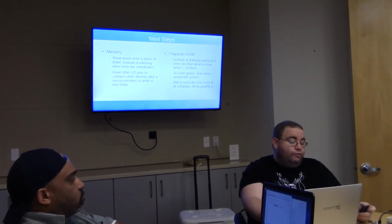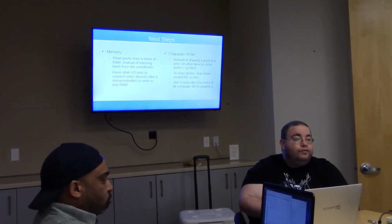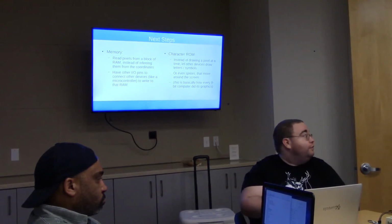So one thing his board does not have is any external memory. So his chip only has the block RAM that is available on the chip, which is 8,192 bytes. You can divide that up however you want. It's just a bunch of flip-flops. There it is.